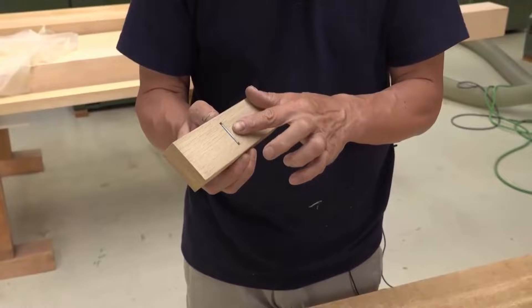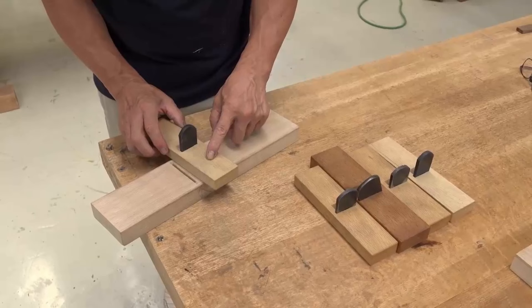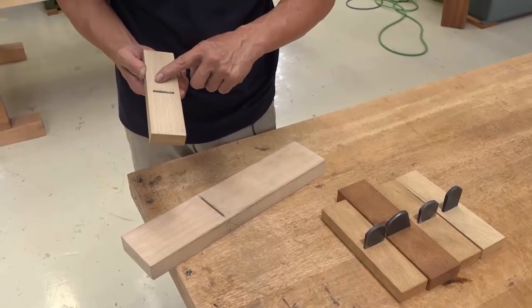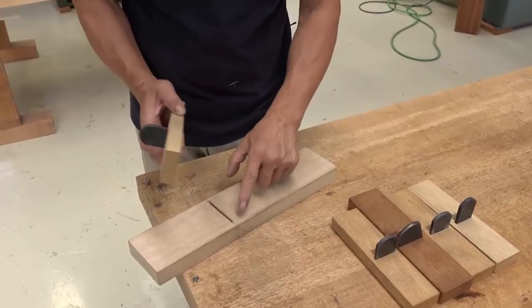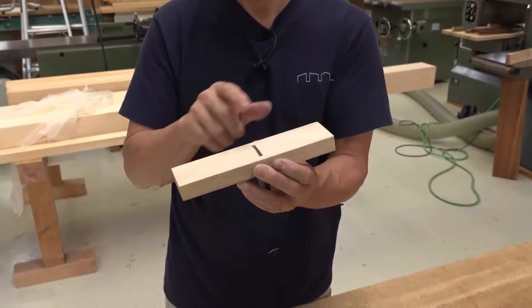It's also important to condition the sole of the scraping plane itself. If you don't frequently flatten the scraping plane's sole, no matter how hard you try, you won't be able to flatten the soles of your other planes. This has already been made flat — completely flat other than the blade, which might protrude to 2 microns. Unlike ordinary planes, if the blade is retracted, the body will change shape, so you must have the blade protruding while you condition its sole. Otherwise it might distort inwards or outwards, so you'll never be able to plane a flat surface. That's why the sole of the scraping plane must be completely flat, and I have to condition it frequently.